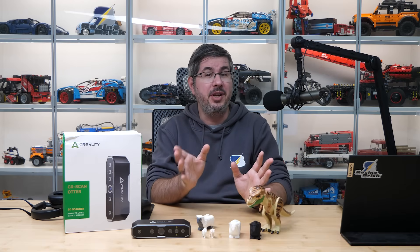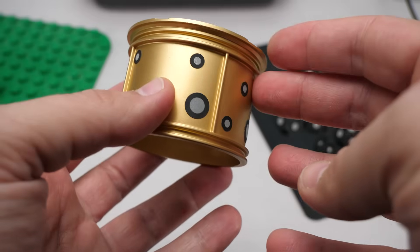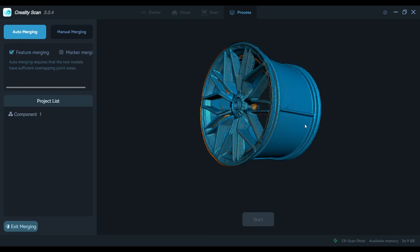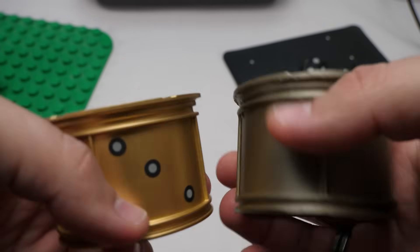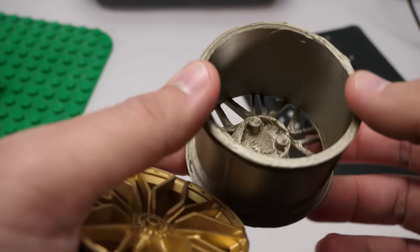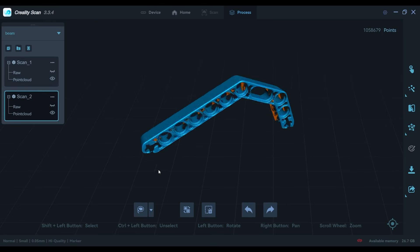Now let's see something functional. I'm obsessed with 3D printed rims — I need to scan some rims. Here's the one from the Cyan. What if I wanted to have it in a different color? This is another tricky object — I had to place the stickers on the rim itself so that the automatic welding functions would recognize the alignment correctly. Apparently the pins inside were too small and too hidden for the scanner — they were not fully captured. And here is the printed version. Not outstanding, it has a few imperfections, and you can see where the stickers were placed on the side — it definitely needs some post-processing. It's probably easier to design a geometric object like this from scratch, or use the scan as a reference or starting point. Technic parts in general don't seem to be a good subject — there are just too many holes and small recessed details that are hard to capture.